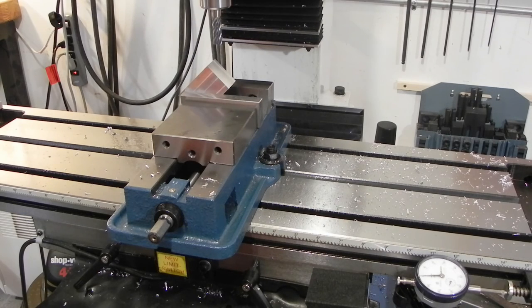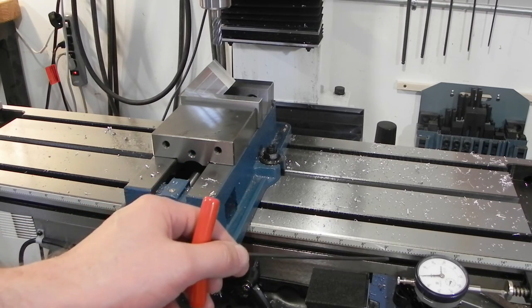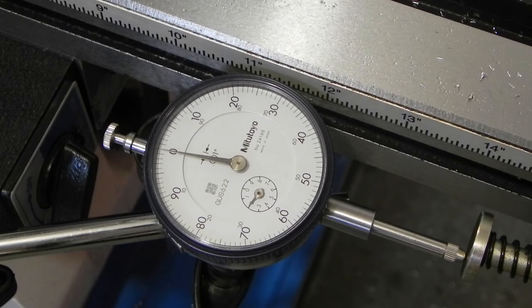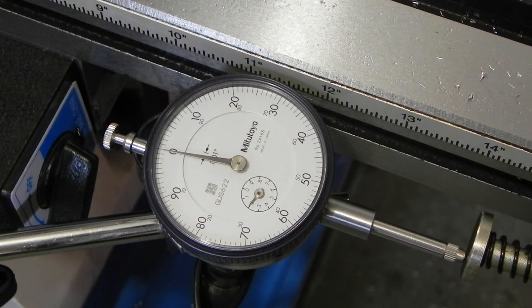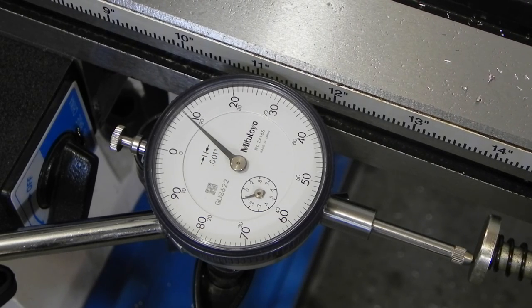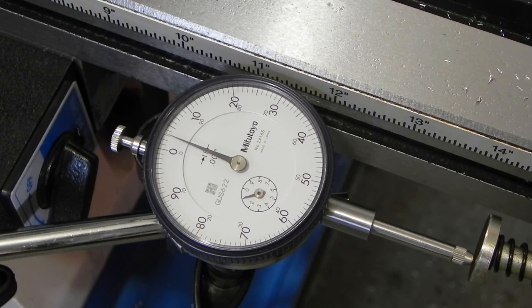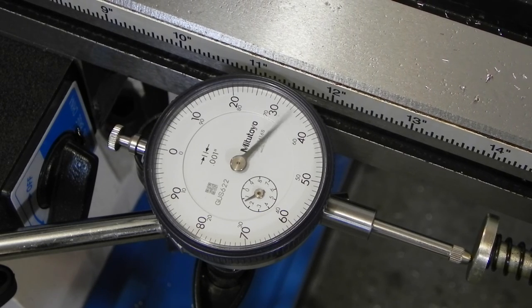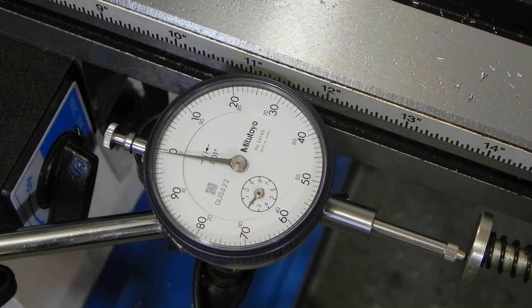I've got the workpiece repositioned and I've got a six flute finishing mill in the spindle. Down here in the bottom right-hand corner of the screen you can see a dial indicator on a mag base. Since my machine doesn't have a DRO and I've got to mill a slot that's got to be a decently accurate width, this is what I came up with. Right now it's at zero to mill one side of the slot, and then if I back out to just three thousandths, that would mill the other side of the slot, taking into account the width of the cutter. So I can start milling, go down to depth, leave five thousandths on each side, get right down to depth, then go back and make my finishing cuts taking a few thousandths off each time.